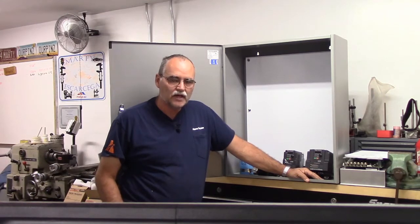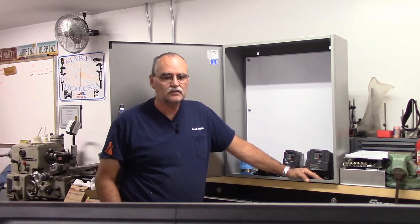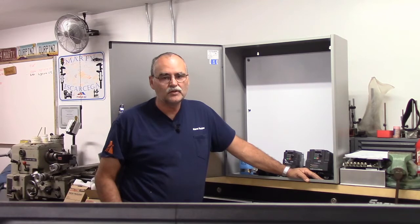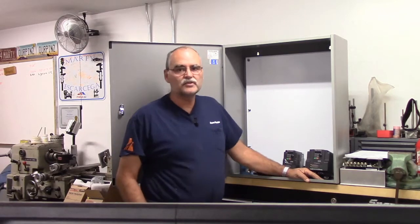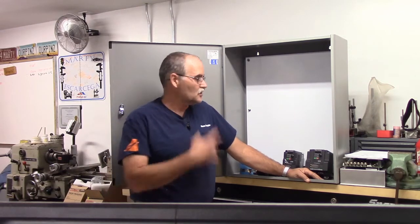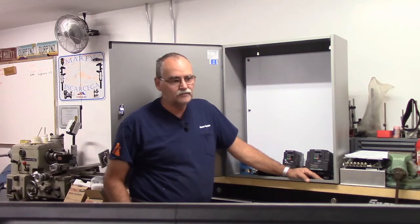I'm getting ready to get back on the CNC mill project, installing the Centroid all-in-one DC motion controller. You've seen me do an overview on the overall project, putting encoders on my servo motors and bench testing the all-in-one DC to get it ready to install and to make sure that everything's functional. So the next step is starting to lay out the equipment cabinet.